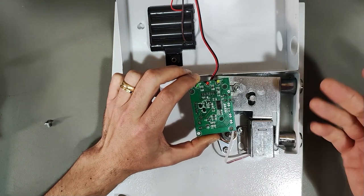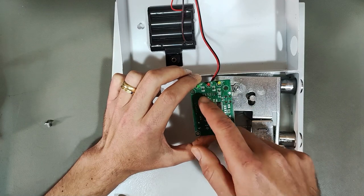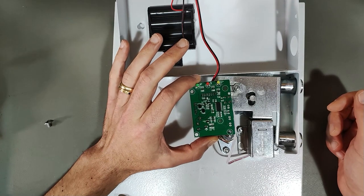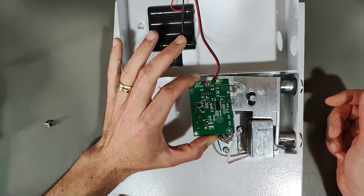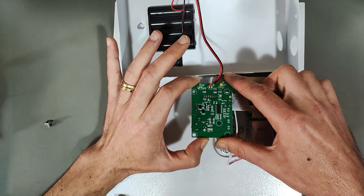So of course I did exactly what I just told you. I used my contact cleaner and paintbrush, scrubbed it, made sure it was nice and spick and span with no more gunk on the board, put it all back together, and for the past couple months it's been working beautifully and it's no longer eating batteries. So, if you have any kind of electronic gizmo and it stops working, you may want to actually take it apart and do that, especially if it's in an area where you can get condensation.